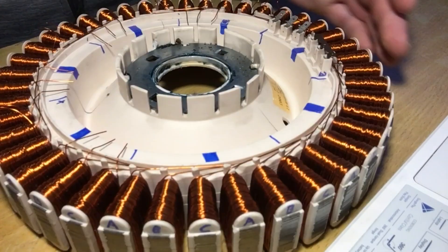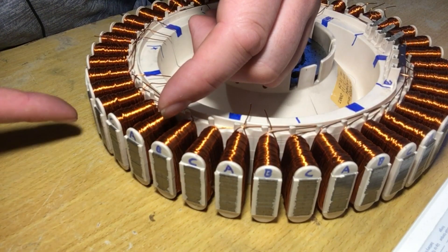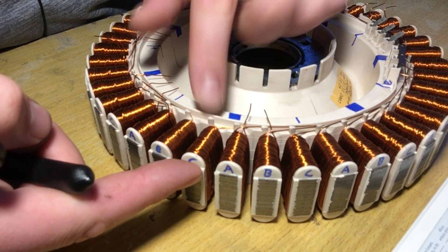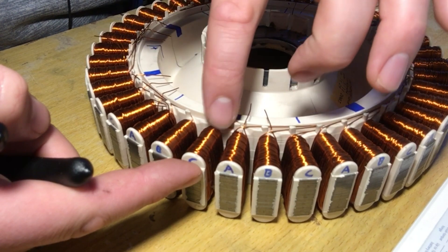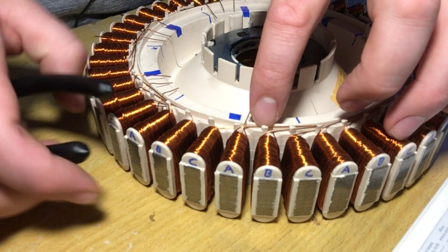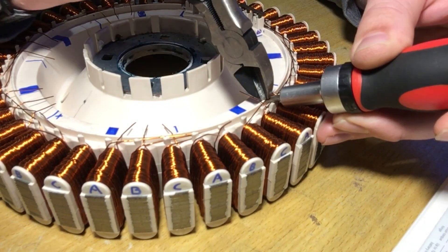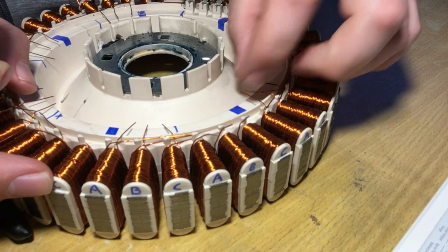Where there's a big blue line there should be no wires. Here we come to C, follow along to the next C, find the wire coming out of it, and cross-reference it to the big blue line where there's supposed to be no wires — so obviously we cut that wire. I like to get a screwdriver, cut it on the screwdriver, fold it back, and fold this one forwards.